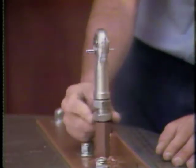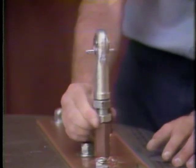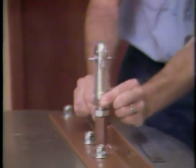The Qualtronics mount has a greasable, self-aligning bearing, reducing wear to an absolute minimum. The mount also has an infinitely adjustable declination offset, allowing for precise trackability regardless of your geographic location. The elevation beam is manufactured from a 4-inch by 4-inch box tube, making it a very rigid beam.